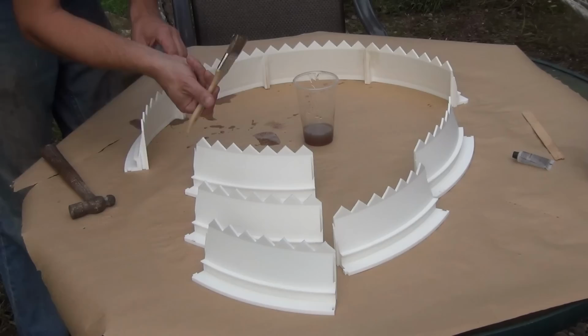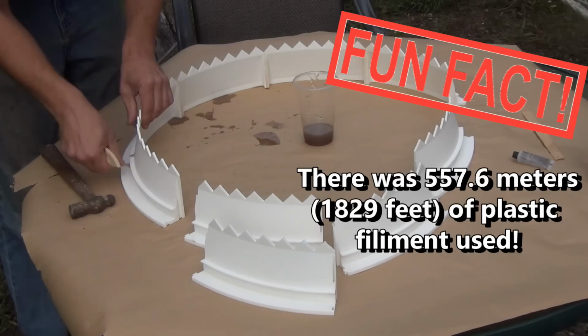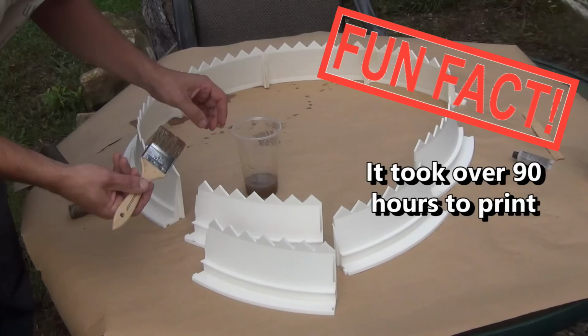The water leaving the settler will flow over this V-notched weir. Instead of trying to fabricate one by cutting and welding sheets of plastic, I thought it'd be an interesting experiment to make one with 3D printed parts. My printer bed can print parts up to 12 inches, so the weir is cut into 9 sections and has a key slot that will interlock the parts together.